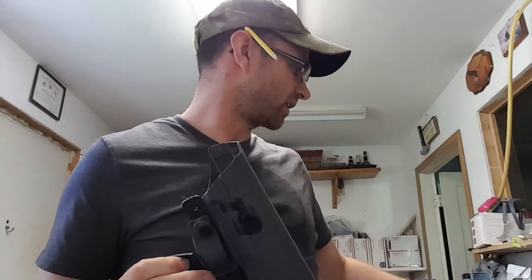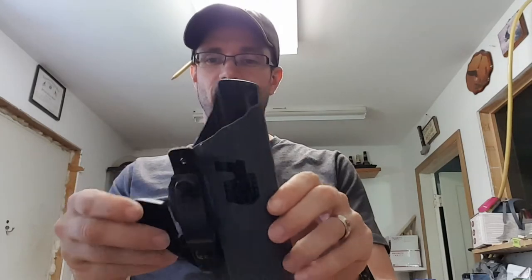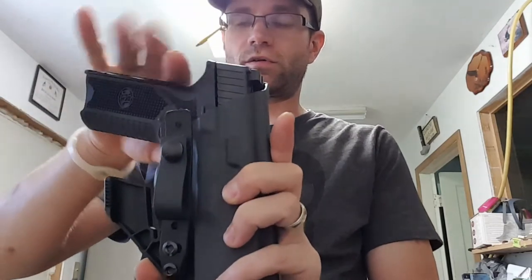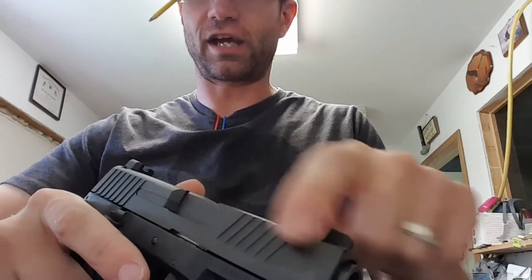I did my final mold revisions last night and finished up blocking and taping everything on the mold this morning, and made this stealth gray — storm gray — holster. Now the gun insertion is nice and smooth, still has that audible pop that you'd expect, there's still no play, the gun's not going to rattle around, but you can insert it over and over and we're not getting any Kydex shavings or any transfer onto the slide.